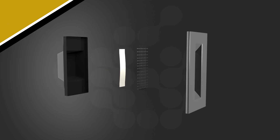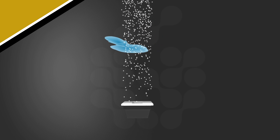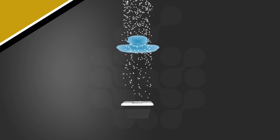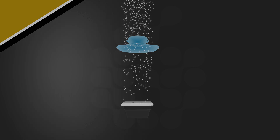Here's an approximation of a true ribbon tweeter. The material is usually stamped aluminum suspended in a magnetic field. They sound great if you are exactly on axis. Moving just a few degrees off axis would cause the high frequencies to drop off dramatically, which is obviously a no-go for any sort of studio monitoring.